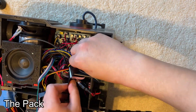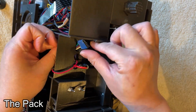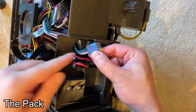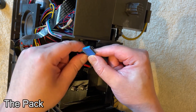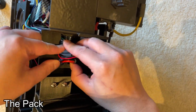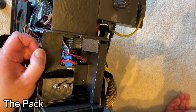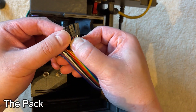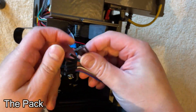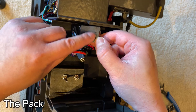One important thing to be careful of: these pins are live because this is forever connected to the board. When you turn the board on, these connections can draw current if touching something else, and you don't want that to cause a short circuit. It's not an elegant solution, but what I've been doing is tucking them away between these two cables, and that seems to be working. Another solution is to take six of the female ends, tape them up like you did with the programming cable, snip the cables off, and then you have a little protective cover for the pins.